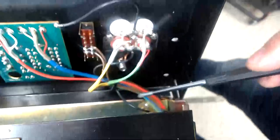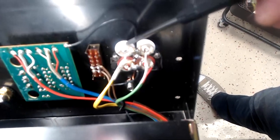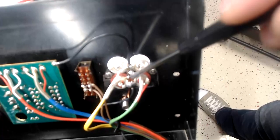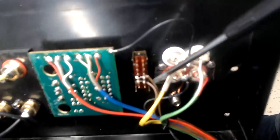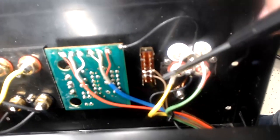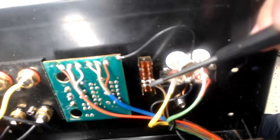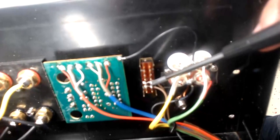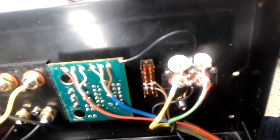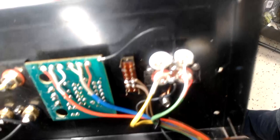This unit has replacement RCAs, and I grounded them on a copper bar and ran my wires to the copper bar. For the coupling switch, as mentioned in my written instructions, the wires — orange or brown, color doesn't matter — bridge across two pins. I skip the first pin and connect my first wire to the second set of pins and my second wire to the third set of pins. That way the switch orientation matches the rear silk screen on the back panel, which labels the positions as 'normal' versus 'direct coupled.'